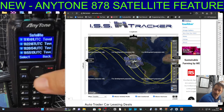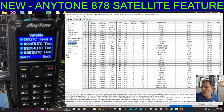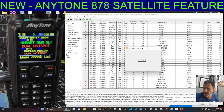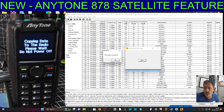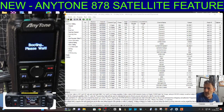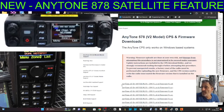Every time you use the satellite feature I would say go back to the software and do the full Tools > Satellite Data Writing - make sure your cable's connected - and write the updated Keps data to the radio. It's very quick. So give it a go! I'm going to check out the 578 next to see if it's already been added - the software version I've got for the 578 is 2.08. Bye for now.